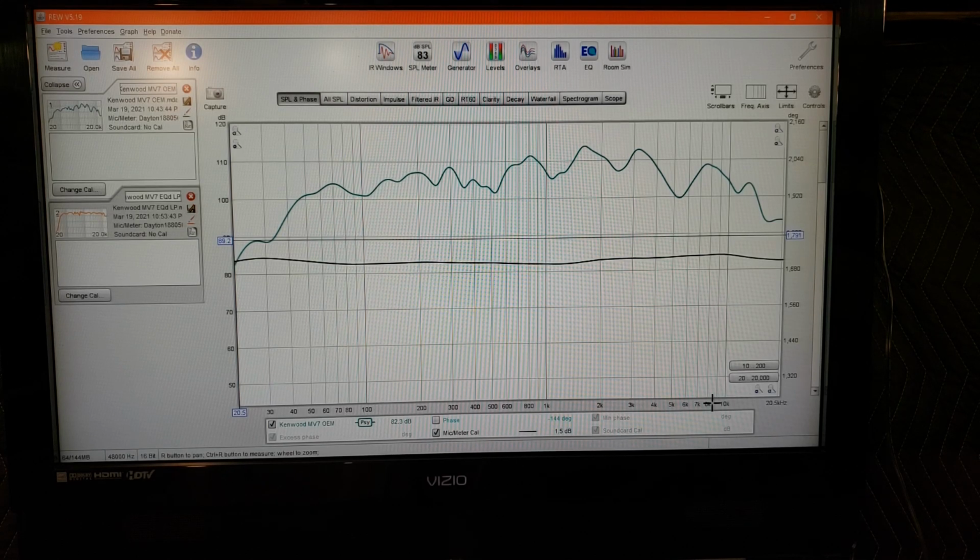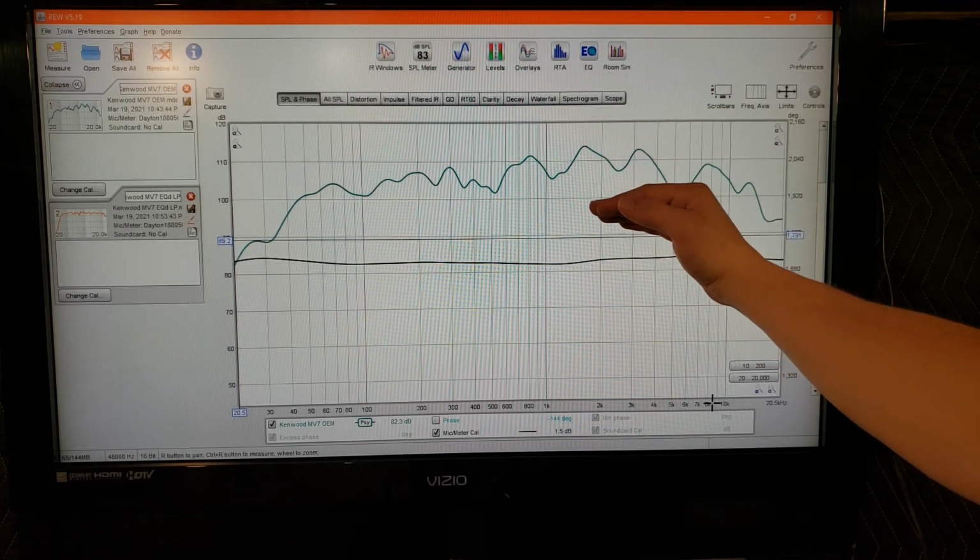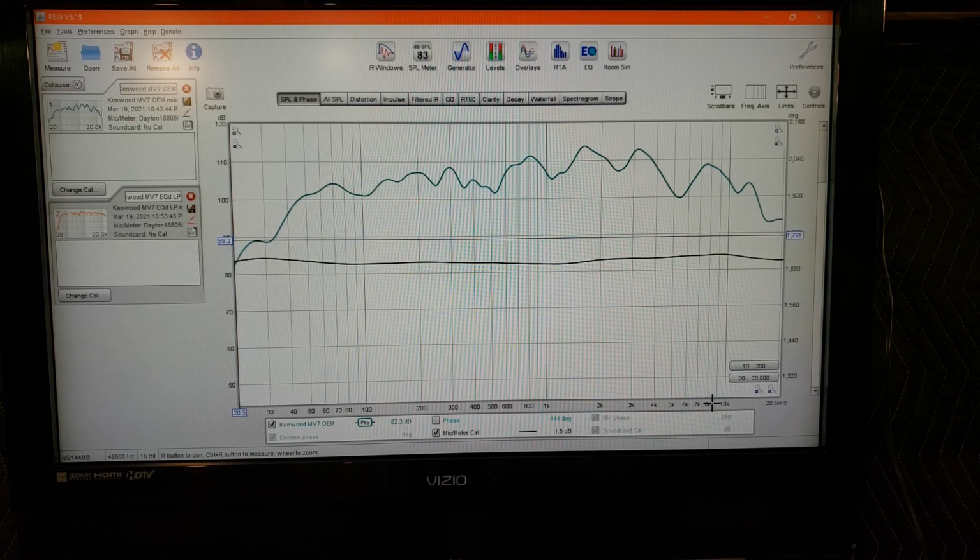It's sometimes they're just so loud and peaky and shouty and shrill. And if you have a receiver that has bass, mid, and treble, you could pull your mid down a little bit, and that might help. Or if you have a physical component graphic EQ, you could use it and get it fairly pleasing to your ear.